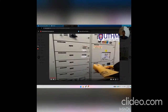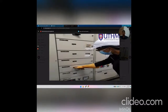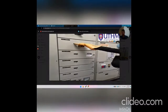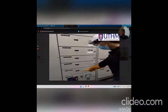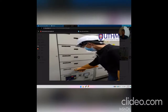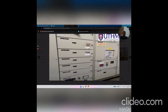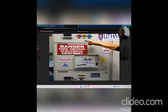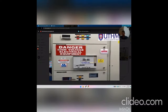First, we must turn off all the load and the power factor capacitor bank, and make sure the power factor capacitor bank is the last one to turn off. And after that, we can check the current at MSB1, which should be 0.